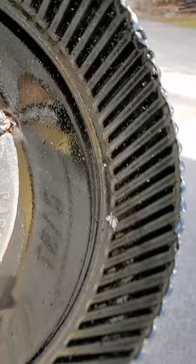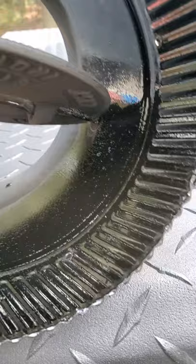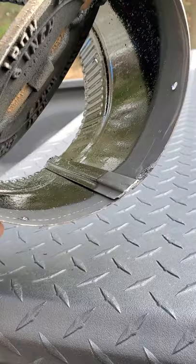That's the creosote we're talking about — slimy, shiny, very pretty, very dangerous. That type of creosote is the most dangerous and can light the quickest. These dampers, if you have them in your chimney, you should probably take them out. We can replace those — we can put just regular stove pipe in.